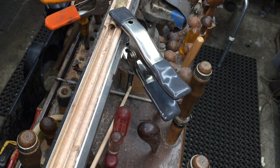As it is now, the loading stick would just barely be the length of the barrel. When there's a charge in there, there's just enough to get your hand on it. Another inch would be a big advantage. And the hole will break out into the frizzen mortise. But don't worry about that. There's nothing we can do about it. The tolerances are so close here that we're working with that it's not weakening anything. So don't be a bit concerned if you see that the loading stick hole actually breaks out into the lock mortise itself.